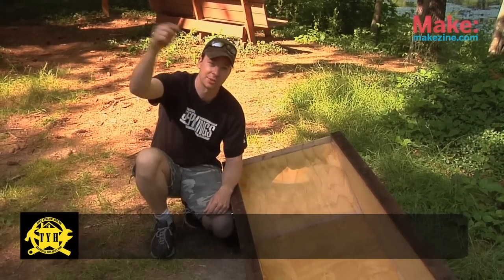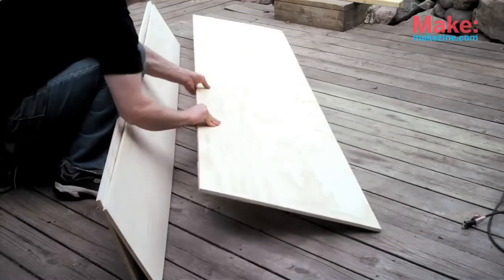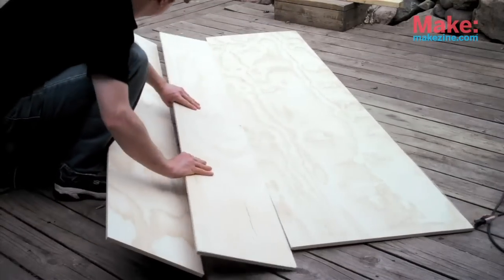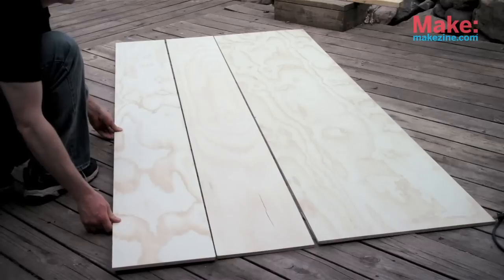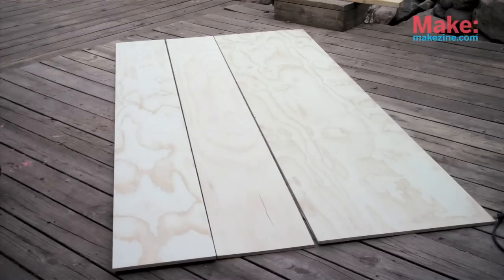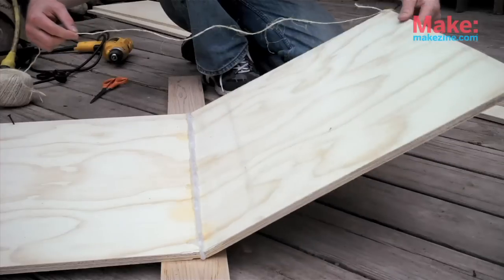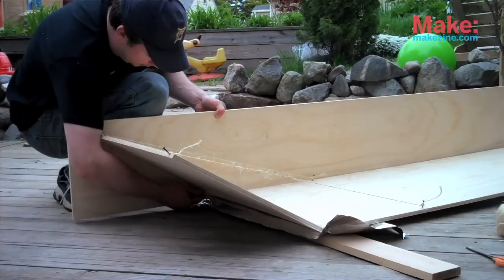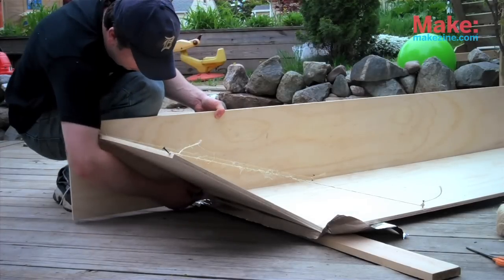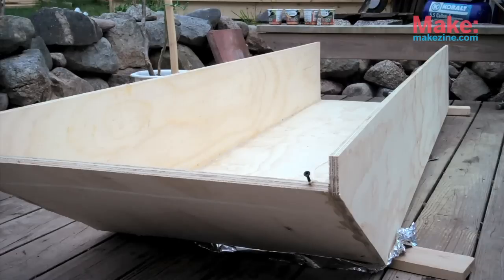We actually forgot one thing material-wise — this right here. First step: go to the hardware store or your box store and buy one sheet of plywood, three-eighths inch or half inch in width. Have them cut it for you — one strip one foot, another one foot, and the last one two feet, which will be the bottom of your boat. Then you're cutting out the sides free-form, drawing one and tracing the other, cutting out a bow, and tacking it all together with two-inch brads.